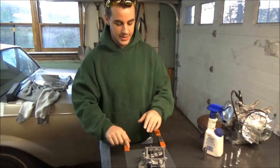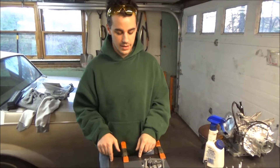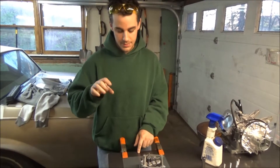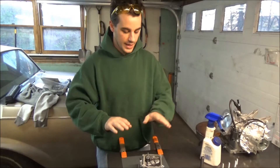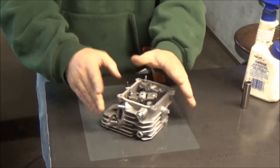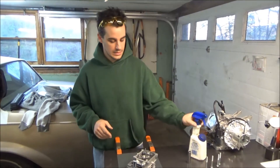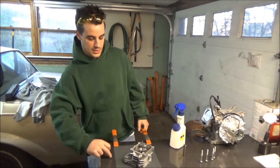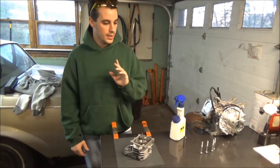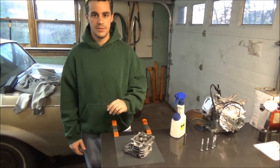So right now I'm just passing it over a little bit on the sandpaper. We did them on the bridge port just with a fly cutter — basic fly cutter. So there's slight ridges even though they seemed more visual, like you really couldn't feel them. I'm just sliding on here, making sure I rotate it a little bit each slide so I don't dig a groove in with the sandpaper. It's important to oil it up. I just sprayed some WD-40, and if you spray it on the surface below it'll actually help it stick more. Just trying to get a little bit better surface — we took some before pictures and we'll show you the before and after.